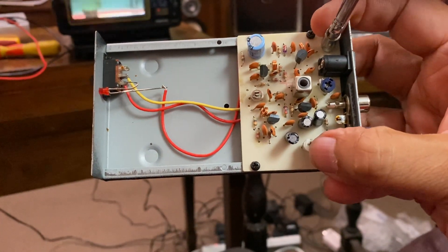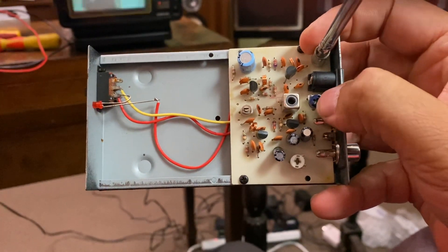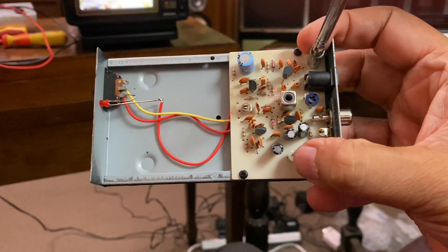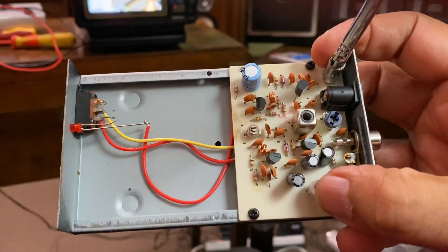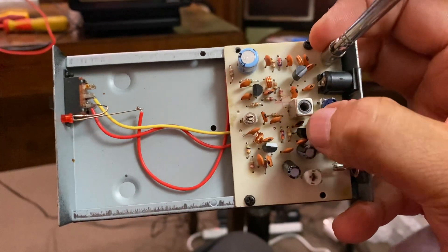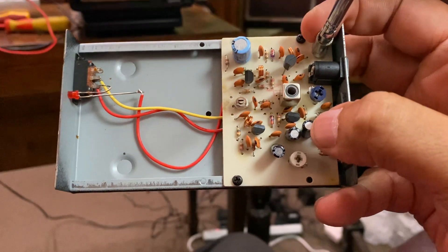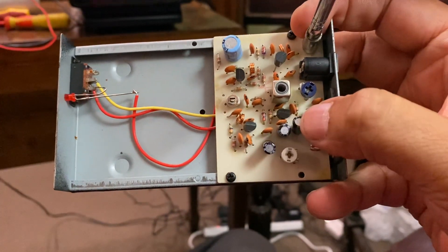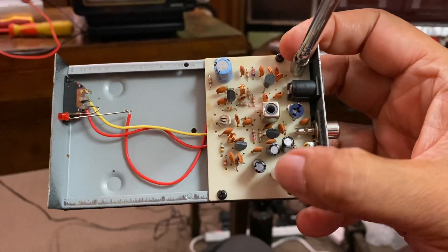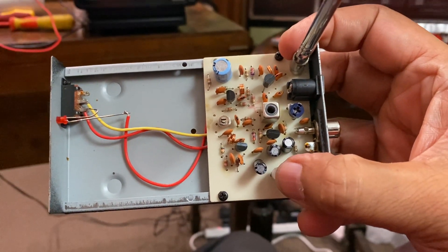This potentiometer is gain for the audio, this one is gain for the video. On both units the video works fine, but on this one the audio does not work. So I took out all three capacitors, checked them — they're perfect. I took out the modulation transistor, checked it — perfect gain of 315 HFE. I put them all back, still no sound. I suspect there's a crack in the board or this potentiometer is gone — that's my current theory.